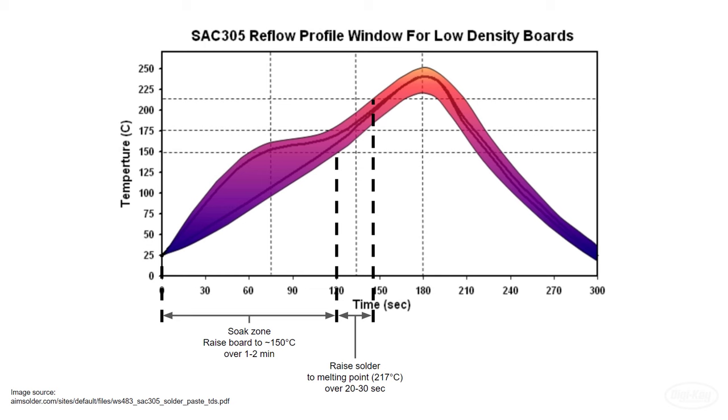The solder will fully reflow and be workable above 225 degrees, but we want to keep it below 250 degrees so that we don't damage the component or the PCB. Note that we only have about 60 seconds at that temperature range to work, or we risk damaging the part or PCB. If you see blisters or bubbles start to appear in the top layer of your PCB, that's known as delamination, and it means things got too hot for too long.